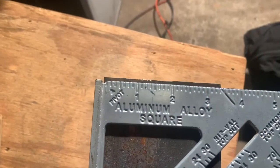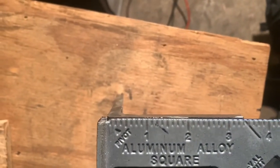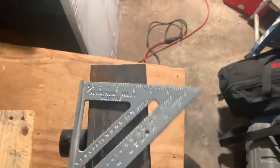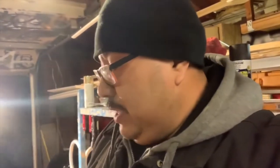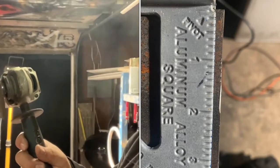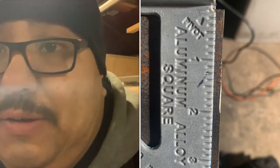Take our square — yeah, that definitely came out better. As you can see, it's pretty level there. That looks really good, so I'm good on this side with the square, but the other side still needs work. I'll change the wheel to a grinder. Just to go over the tools we used: I used the grinder with the abrasive wheel — the guard came off, of course — to smooth out the edges and level it out a little bit.